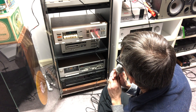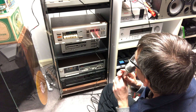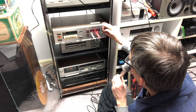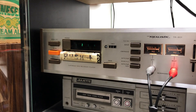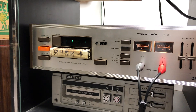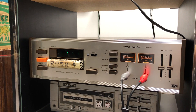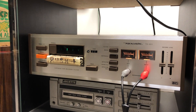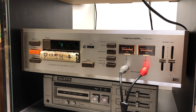And that turned a different color. I've got to turn the microphone on. The VU meter is definitely moving back and forth. 'Hello, this is testing. Does this actually work?' I'm trying to turn the record level down a little bit. What's going to be interesting is, of course, I can't rewind — you can't rewind on an 8-track. You might be able to fast forward, but there's no rewind option. The song just cut out — and it recorded. Playing back: 'This is testing. Does this actually work? Turning the record level down a little bit.'